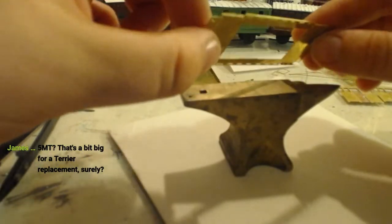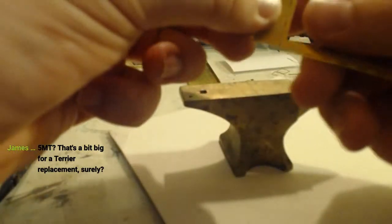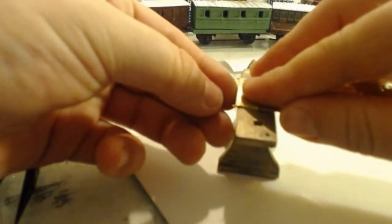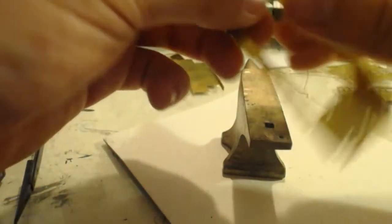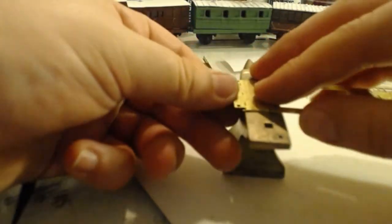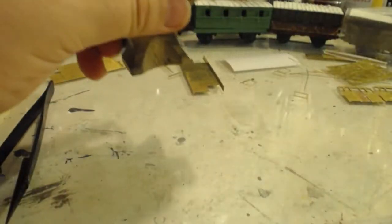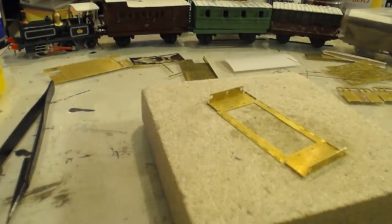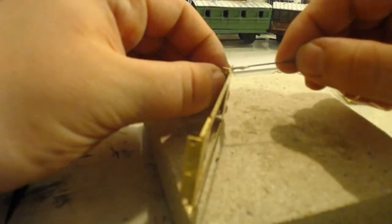Tin the outer face of the flange. So we want to tin these bits and then bend down these bits? I think not. Do our bending first. And then tin them. Because bending and tinning means a change of tools. And why would I change tools to instantly change them back when working on the same part?